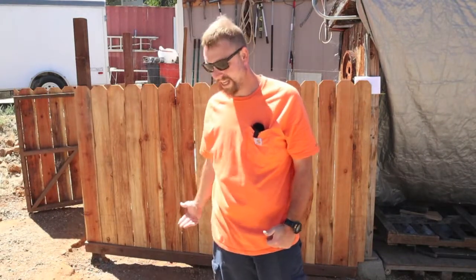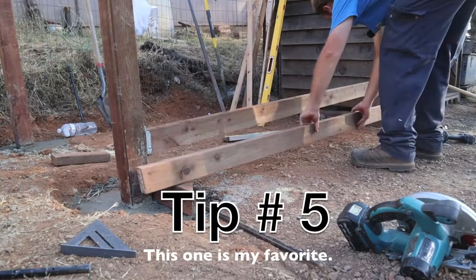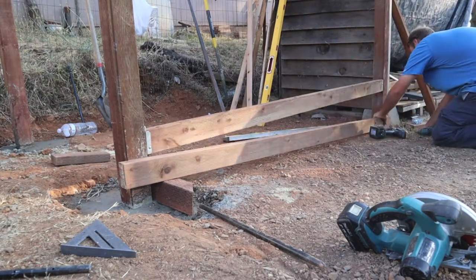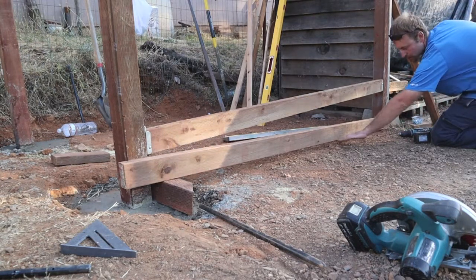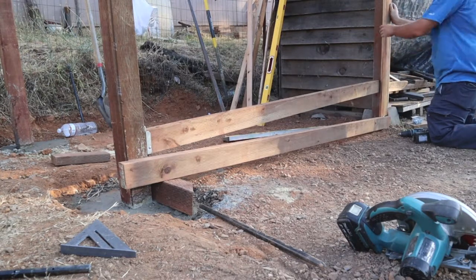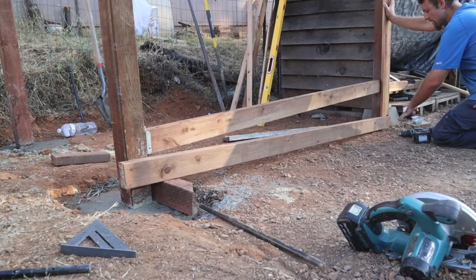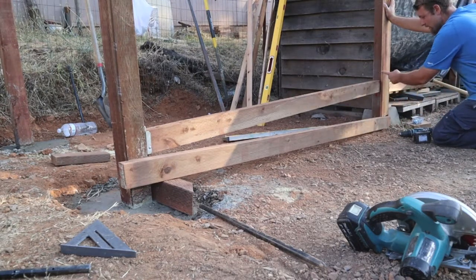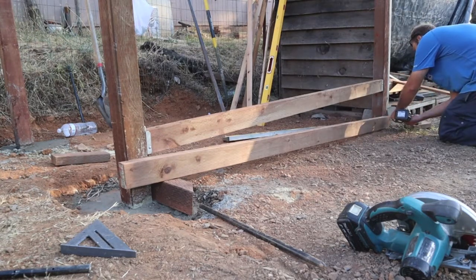This tip — I think it's the coolest thing. It really ups the fence game. So if there's one tip you take away from this, I would hope this would be the one. This board here: the way it works is you put this in at just about ground level — I'm going to bring it up a bit with gravel — and then your fence boards butt into that. What that does is it keeps the fence boards off the ground. If they're stuck in the dirt all the time, they break, and you're weed-eating through there and just beating them up. This keeps them up off the ground and will last a lot longer than the fence boards. It also just gives a clean look. Typically I'll pre-drill, especially when you're this close to the edge.